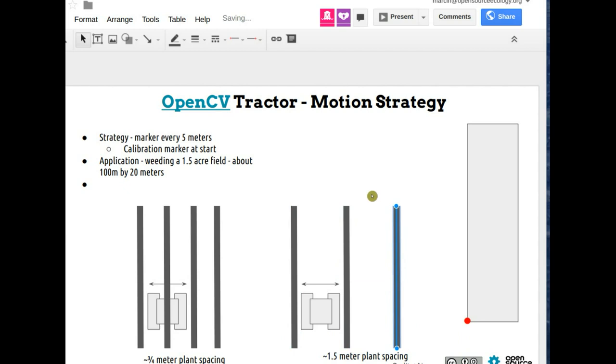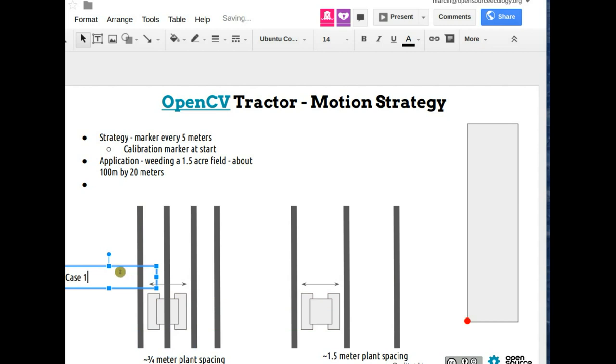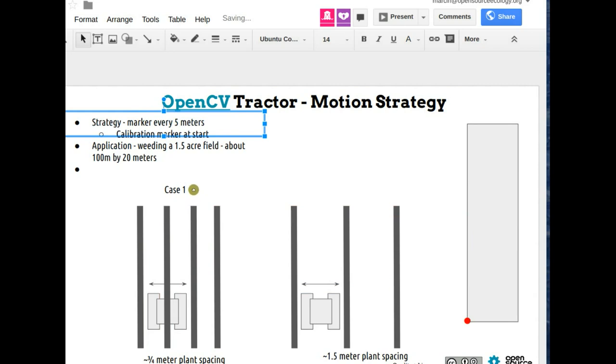It is? Yes, because if we allow for half a meter or a bit lower underneath the tractor, then we can just make sure that the camera is seeing the poles or the markers at the center of the tractor and just moving straight ahead. But having the markers over the side of the tractor will be an issue. Then we have to adjust all the angles, and in one picture we may be seeing 2 points from 2 angles, and we have to deal with segmenting the image and making sure that we're following either the right or the left, or centering the tractor based on the right and the left. So it would mean more processing.